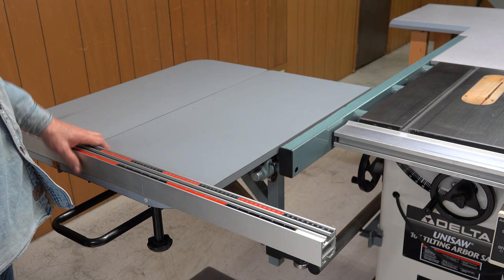And number 28 is actually putting like a 30-degree angle here at the edge of the table. And you can see how that's been done. That's so when you move thick material or thin material through here, or warped material through the rolling table, that it doesn't slam into your next edge and it continues on to the next table.